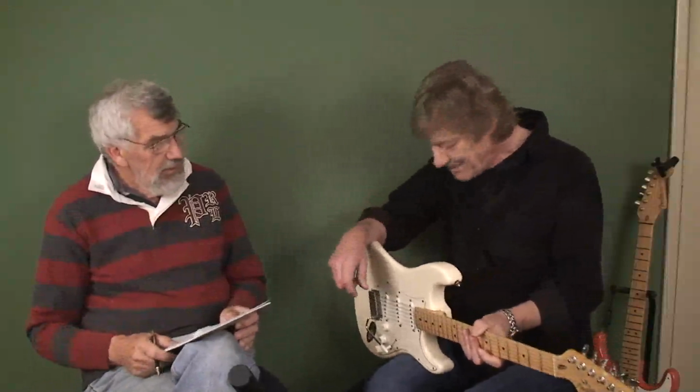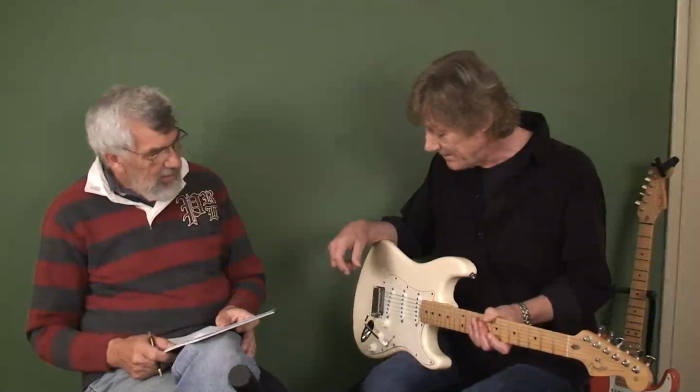Just a bit. It's got CS54 pickups in it, set fairly low in a nice sweet spot. The trem action has got 3 springs on it, which balances the slightly heavier strings nicely. It's not too stiff. The instrument was actually set up by Kevin Reeves, who's Hank's Oz guitar tech. So he did all the fret work for me, and it plays rather nicely. And it does play very nicely indeed. Yes. So that's the instrument.